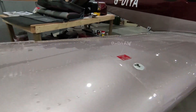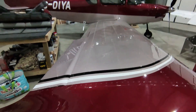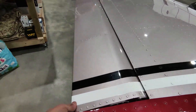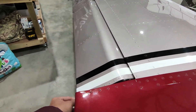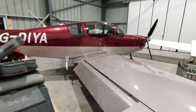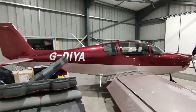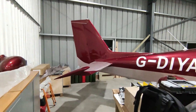There's a lot of paperwork trying to get everything nailed down. It was quite tricky to get the aileron deflections spot on as per the POH. The rudder, however, even though the POH says plus or minus two degrees, you get a lot more deflection on the starboard side, so I had to get confirmation from the factory that they allow up to plus ten degrees of deflection on the starboard side — essentially it's a minimum deflection requirement and the factory has increased the maximum limit, so pretty much all Slings are built to that level.